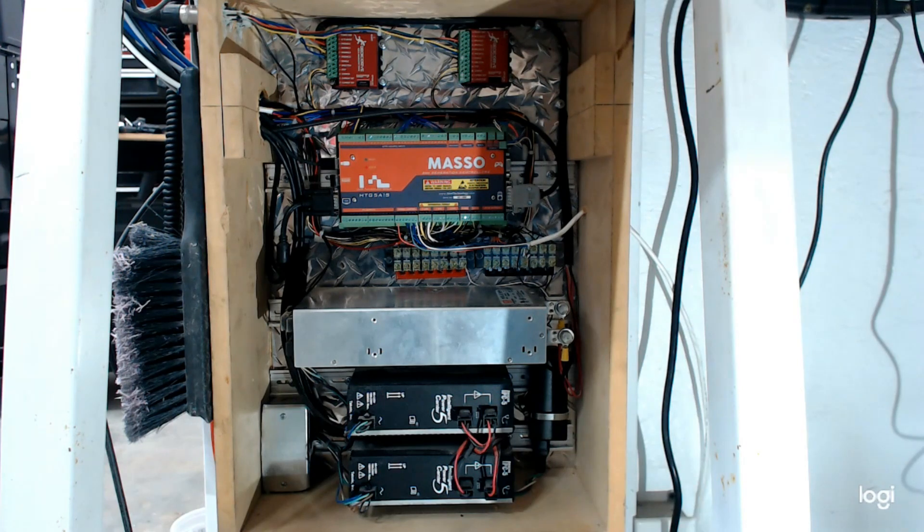Let's go through what we've got here. At the top you can see the two Gecko drives — those are controlling the NEMA 23s on the head unit, which is probably not a problem given that it runs really slowly. Then the Masso unit itself, then a power supply — which is way overkill, left over from the original configuration — and then the two power supplies for the Clearpath drives. It's very straightforward, easy to configure, and easy to maintain. You upload G-code by USB drive. I would highly recommend this setup — it goes from 3-axis to 5-axis with just a software configuration, and I think it's actually cheaper than running a PC with all the other parts and pieces.